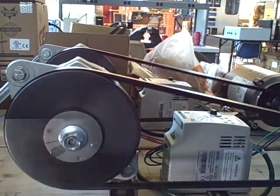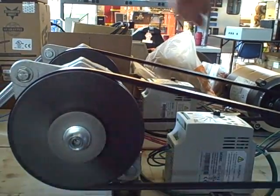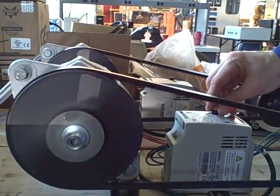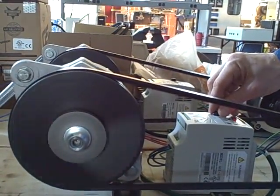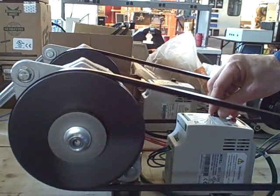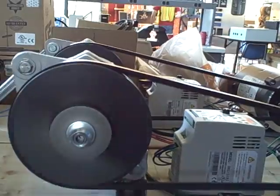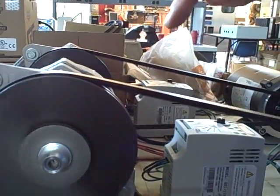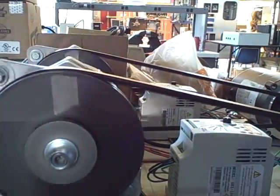Now I'm going to speed up the prime mover on this, and when I do so, you'll see the tapes come closer into alignment with each other. Counting back up from 59.2 to 60 hertz. So now with 60 hertz going to the driving motor, it's trying to spin exactly as fast as the other driving motor, and what you see here is better alignment of those two pieces of tape.